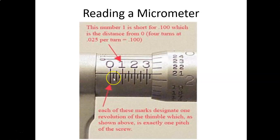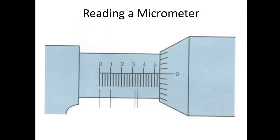And it starts over again. You've got 125, 150, 175, and then 200. Well, you can look at that as $2. Just one way maybe to help remember it. So here's a slide that's going to show you colored in 25 thousandths, and another 25 makes 50, and another 25 makes 75 thousandths. And another 25 makes 100 thousandths, written out as 0.100.